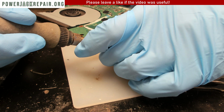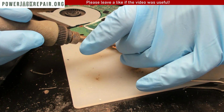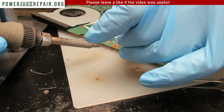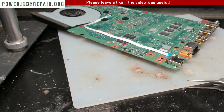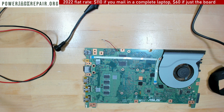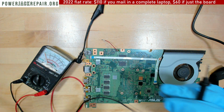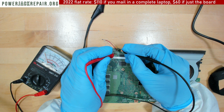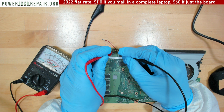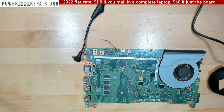That's the other way. Okay. Good job. Alright, I'm not sure when I pressed the pause button, but the problem turned out to be that we get the voltage here going through and it goes well. But when I measure the continuity on this capacitor right here, we get 0 on this guy. So let me remove the capacitor and let me remove the wire.